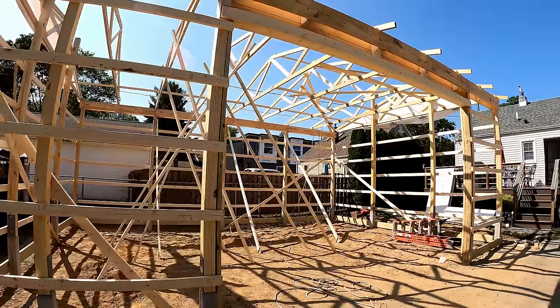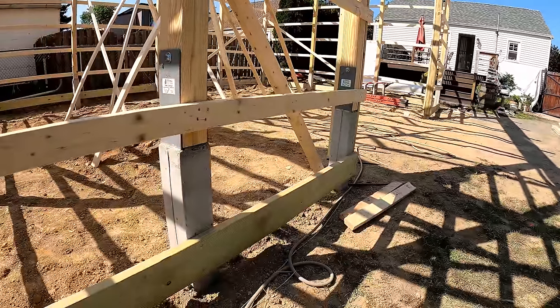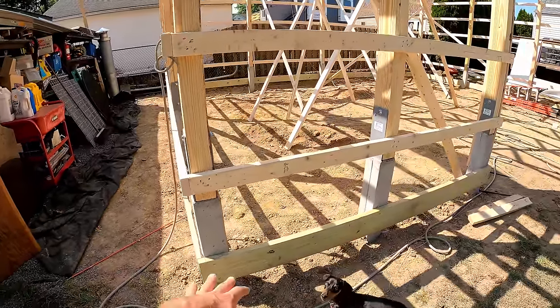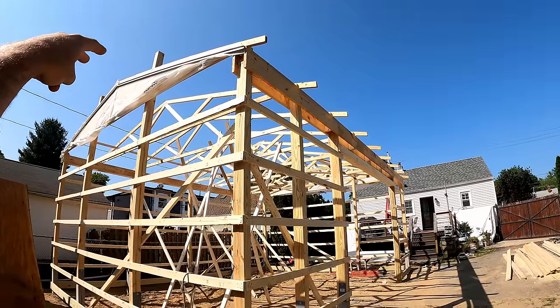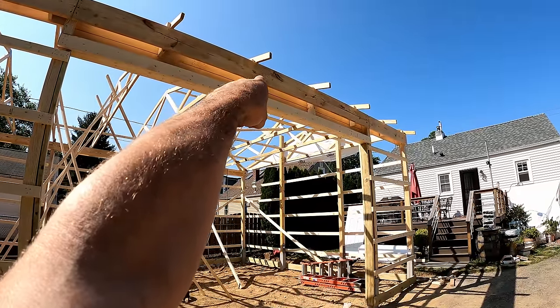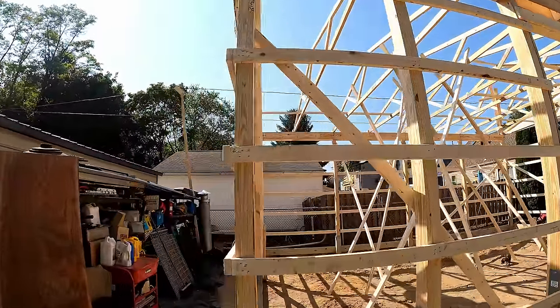They did great work and this is how we're looking. So happy we went with the permacolumns - we don't have to worry about the wood rotting out in the ground. It's got the pressure-treated bottom and the concrete will be coming up a fair bit. I went with 3-over-12 trusses to keep it a little bit lower. Really this isn't much higher than the old garage - the old peak was actually just as high as that, so it's not far off.